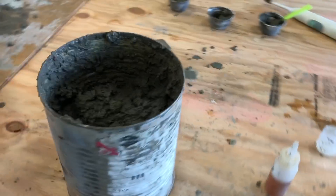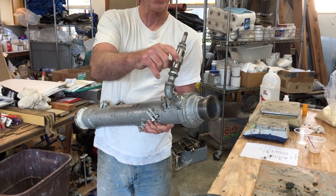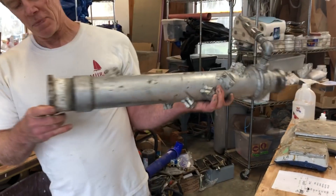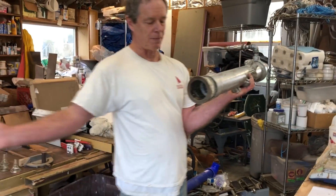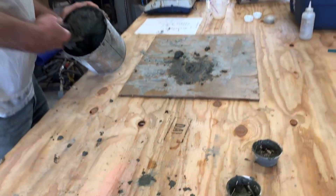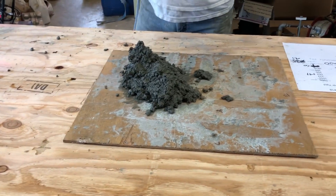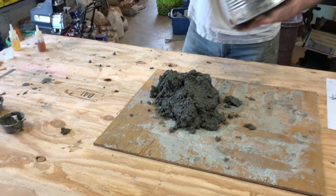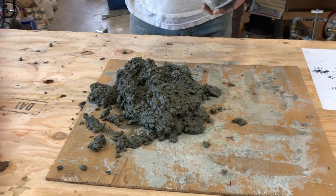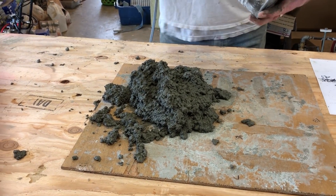Normally this would be injected in our inline admixer. This guy is on the pump line — the admixture goes in this inlet here through a little check valve. You can see what it looks like down the middle of this guy — pretty torturous path. Does a really good job of mixing in line, and then off the end of this we have at least about 10 feet of hose to continue the mixing process. This mix has both Delvo and water reducer in it — about six pounds of Delvo and four and a half pounds of the PCE.